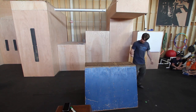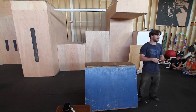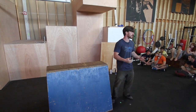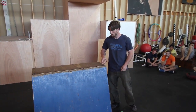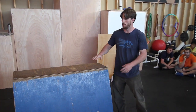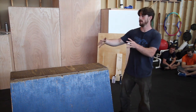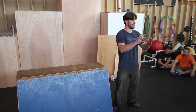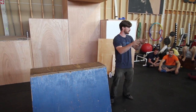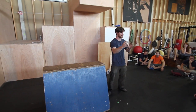The more fasteners you have, the better each one is going to do at resisting pullout. If you only have a few, all the force ends up in those and they start pulling out. The more important role of fasteners in something like a box is to actually tie the entire shape together. When building a box, we recommend building a frame first and then attaching whatever sheeting you're using — wood on the outside, whatever you have.